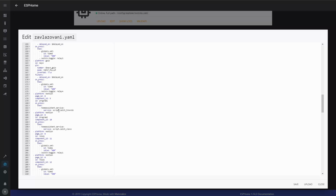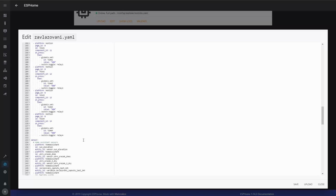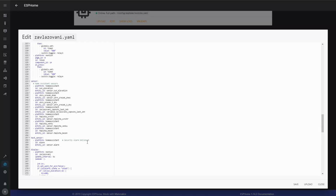And I have 2 programs for that, one for the full garden and one for one of the sections. And then what I have also defined is on the display there are those 4 columns representing those 4 relays for the 4 different circuits, and I actually define them as buttons as well. So when I push them with the finger, they do exactly the same as if I would press the physical button on the box. I thought it's kind of more intuitive doing that.